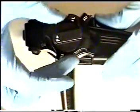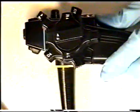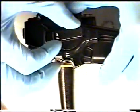By flicking the left-right free button to the lock position, we test to make sure that the knobs do lock and retroflex the distal end by holding it in place. To check to be sure that it is free, flick it to the free position and the knobs should bend back to a loose position.